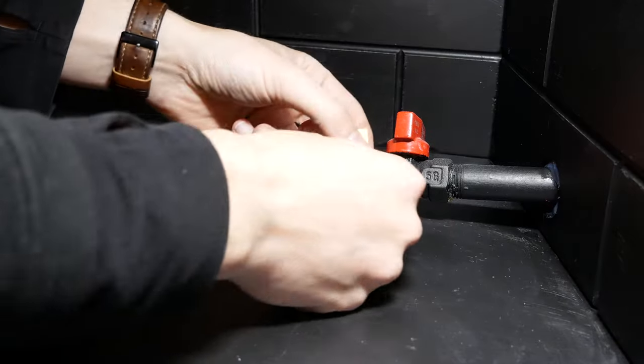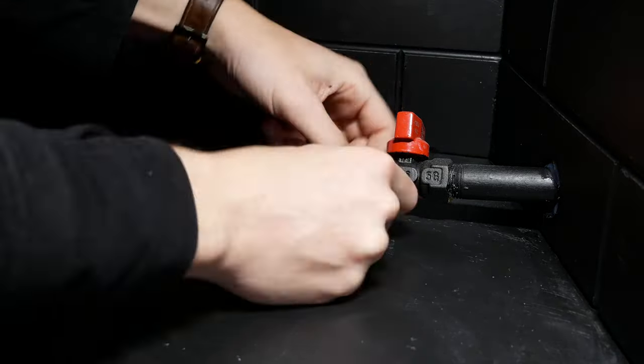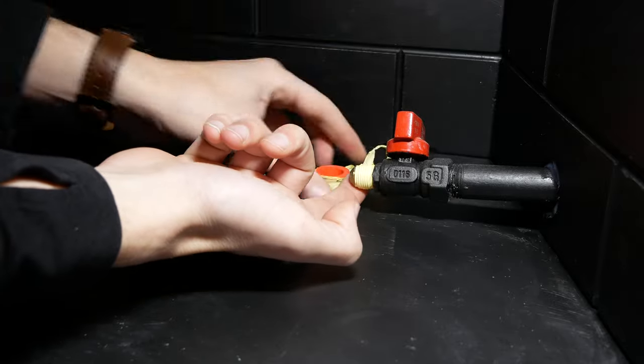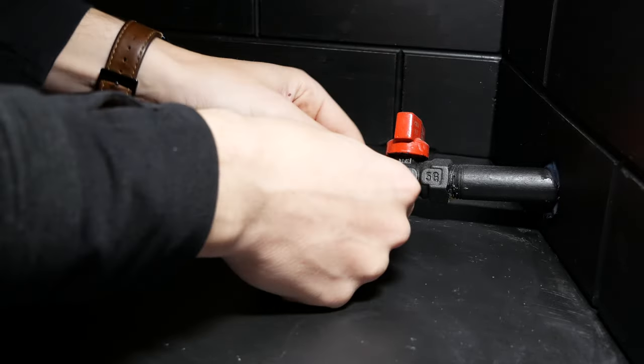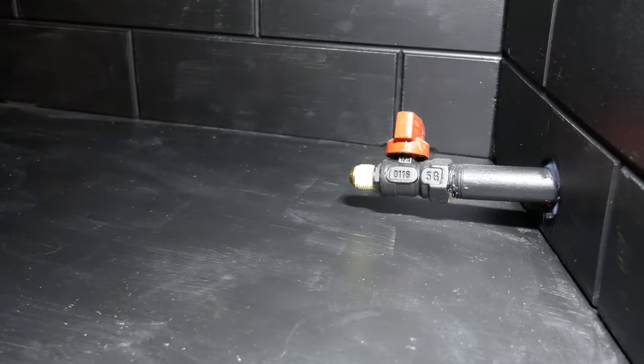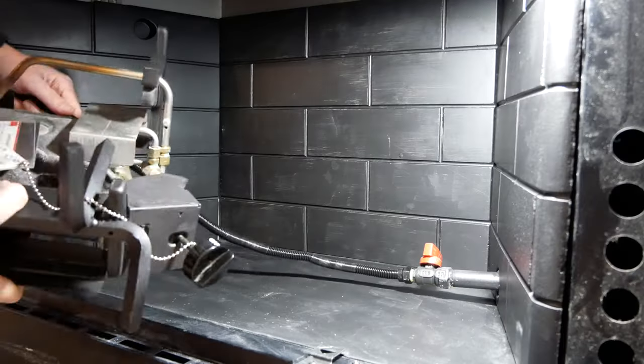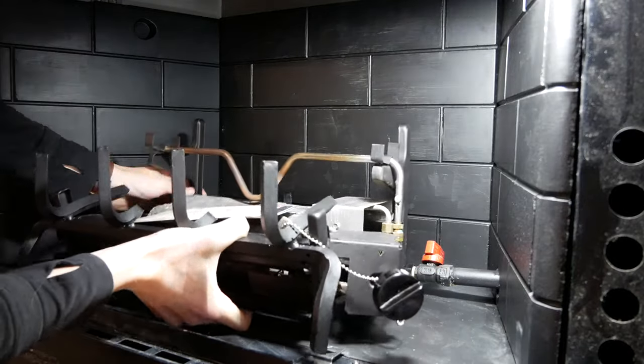And it's time to put it all back together. I wrapped yellow PTFE tape made for gas lines around the threads of the main line a few times. It's important to wrap the tape in a clockwise direction so it doesn't bunch or come loose when screwing something onto it. Then I screwed on and tightened a new black flexible gas line, slid the unit over the flexible line, and set it in place.